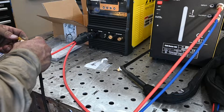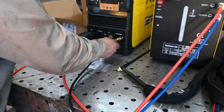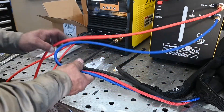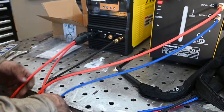All total this was about a hundred dollars for the adapter and this fitting. This is a standard type of argon fitting — right-hand thread — and this will quick-connect to your machine. So now my torch will have its gas flow for argon and of course water supply to cool the torch head, with return back to the tank to cool the fluid back down.